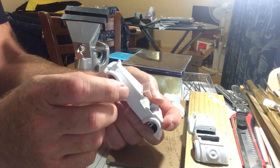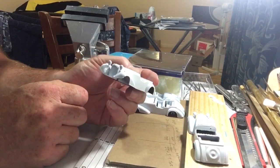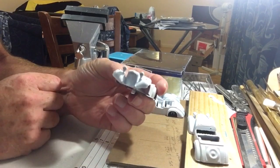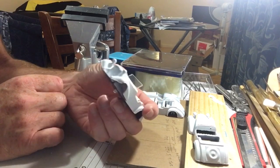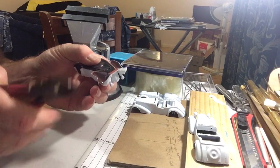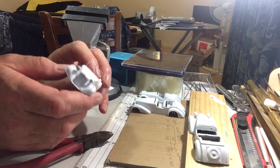Plastic lids off CD covers. That is perfect. Trim off the tab so it's level with the base plate. What a perler. Patent that, put my name on it. I'm just flabbergasted, but that is the Elite Diecast Restoration patented Dinky Toy windscreen replacement method. And you'd be mad to do anything else. Can't beat it.